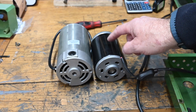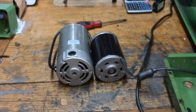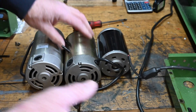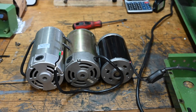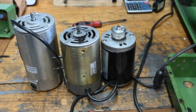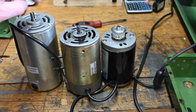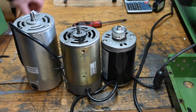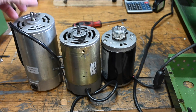Here's the old and the new — well, it's the new old, the one I put on as a replacement. This was the motor that it came with, that was burnt out, which I believe is a 400 watt motor. Of course the one I put on is only 200 watts. As you can see, that's nowhere near going to be good enough, so I'm putting this one on now. The shaft on this one is smaller than the shaft on that one, so this cog is not going to be any good — that gear is going to have to go. I've got a new gear, so I'm going to get a hole in that to suit this spindle and then I can put that on and fit this new motor.